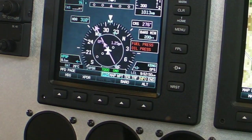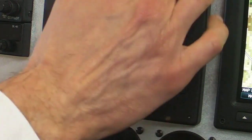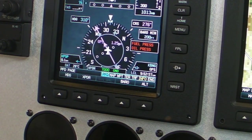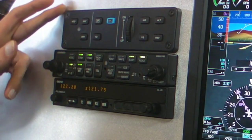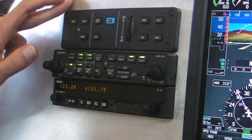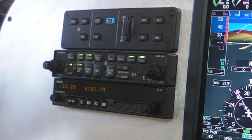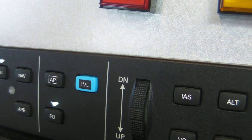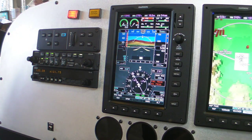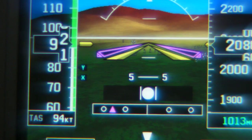Primarily, your autopilot functionality can be controlled by your primary flight display using soft keys and the buttons and knobs. But if you want more capability, we have our optional GMC-305. For about $800, this mode controller gives you a level button that will allow the airplane to recover from an unusual attitude just by pressing that blue button. You also get the ability to fly with a flight director without actually having the autopilot engaged.